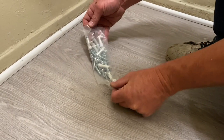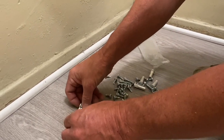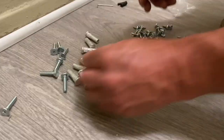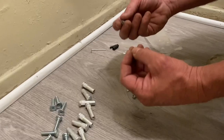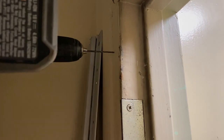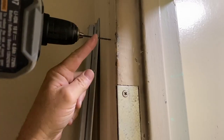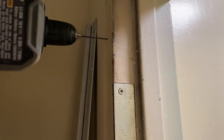Here's the bag of screws that come with it, along with a little Allen wrench. These are the through bolts — they're going to go in those big holes that'll go through the door, and those get paired with these. Then you have all of these self-tapping sheet metal screws, which will go into the jamb and into the door as well. It's easier to pre-drill. Sometimes the self-tapping screws will go right into the metal, but sometimes there's concrete, wood, or just air behind there. There's nothing behind here, so we can go right in with our screws.